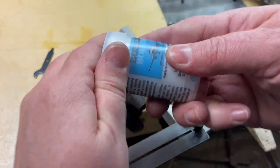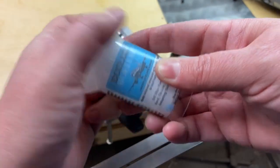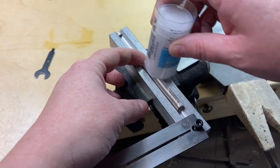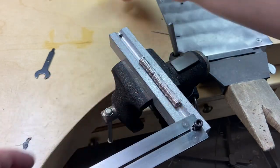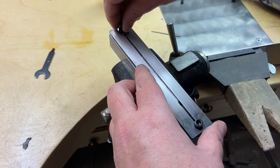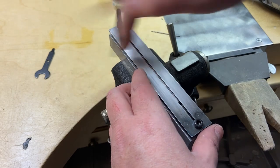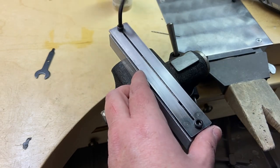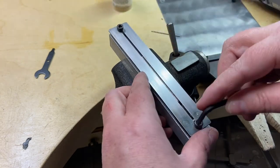Place the wire coil in the groove of the coil holder base. Apply cut lube along the top of the coil or thoroughly coat the blade. This extends the life of the blade and provides better cuts. Place the slotted coil holder top on the coil with the stop facing down and toward the left. Use a thin tool to push the coil all the way to the left until it's up against the welded stop.